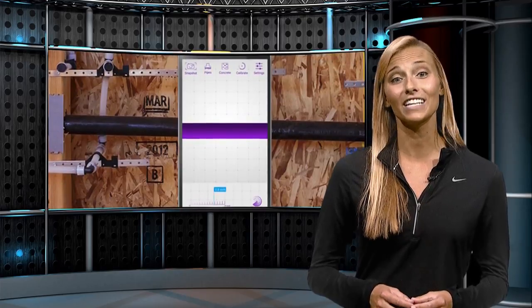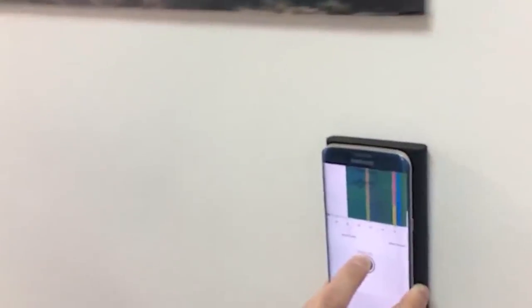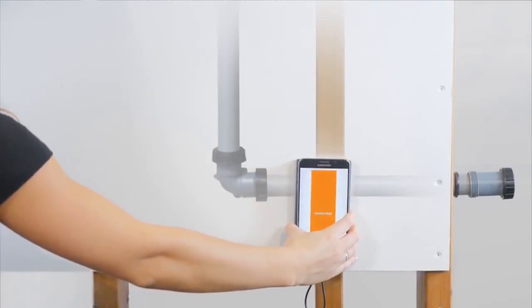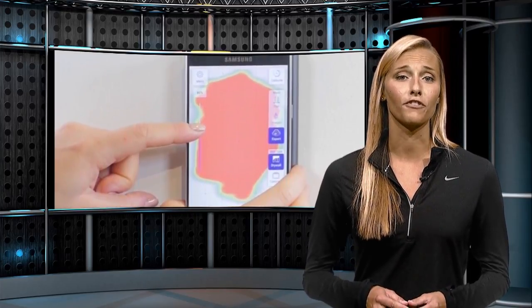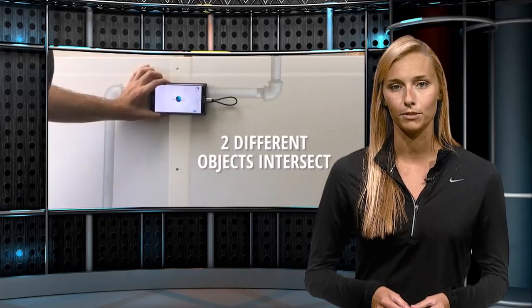This device is really easy to use. Set to pan mode to find out the distance between the studs and get a panoramic view of a full wall line. Then you can switch to image mode to see a visual image of what is actually in the wall. If you put it in expert mode, you can get a little closer look at the stud, because expert mode offers better location and more detail. You can see things like curves in the pipes and wires as well as the intersection between two objects.